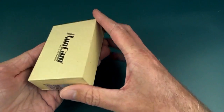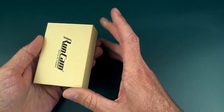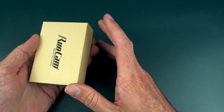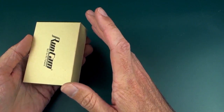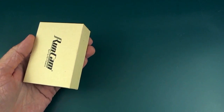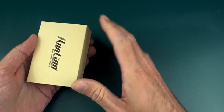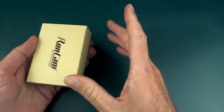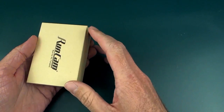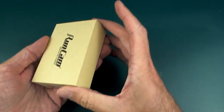Well, I'm sure you all know how big these are, but inside here, believe it or not, we have an Arduino Pro Mini, a GPS module, two temperature sensors, two barometers, a humidity sensor, accelerometer, a GSM cell phone network module, NRF24 radio transceiver, SD card reader, voltage divider, that's just two resistors really. Sorry, no, the voltage divider is just the two resistors, and there's a voltage regulator to step the voltage down to 3.3 volts. There's a little buzzer, and there's also an LED. All in here. Pretty neat, hey?